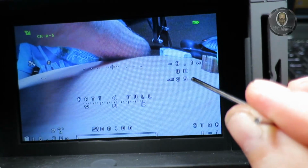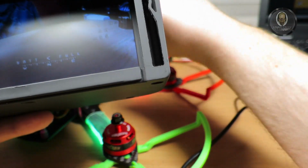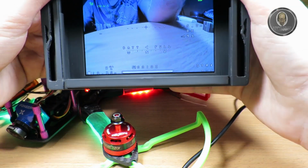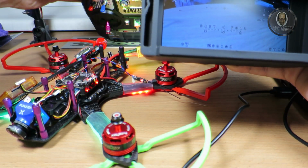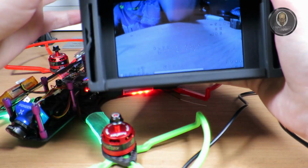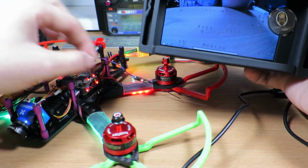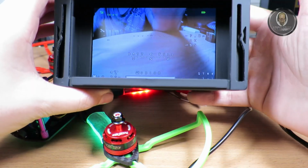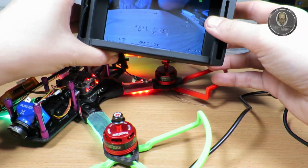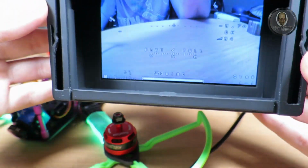In here I can see the RSSI, and I have 95% because the antennas are laying like this. I checked it, I took it to the kitchen, and it was going down, so it is working fine. As you can see, it is changing the power, because now it would probably be 100%, so that's working fine. This just needed to be disconnected and connected again to get the signal, because the setup was showing 0. Now it's showing 95, 94. It depends on how it's set. Probably the FPV is covering it. Maybe the screen, yes, 94, 93, 95.